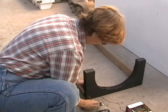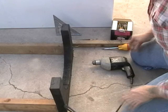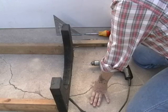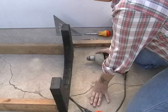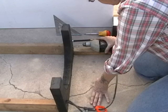For those of you that have subscribed to this project and are watching it regularly and paying really close attention to the details, you no doubt notice my tendency to drill at an angle where it should be perpendicular to the surface I'm drilling. It's a bad habit. I try to catch it when I can. But on this project, where I have to drill through the base of the support board and into the 2x4 to connect both support boards, both uprights, I used the patio itself as a level and went in that hole that way. And then for the next hole up, I just got a little piece of wood and laid it underneath there, and then laid my drill on top of that and just used that as my level. That way there's no way I can be crooked.